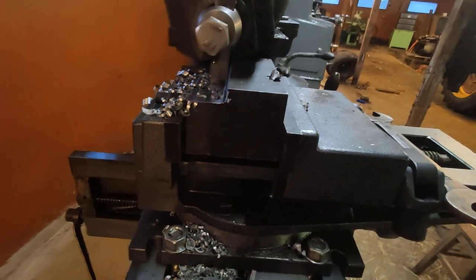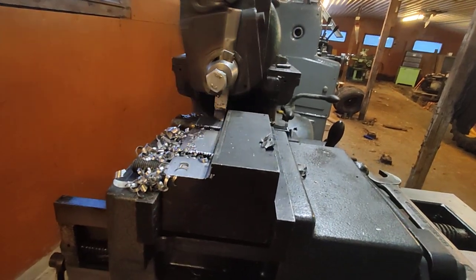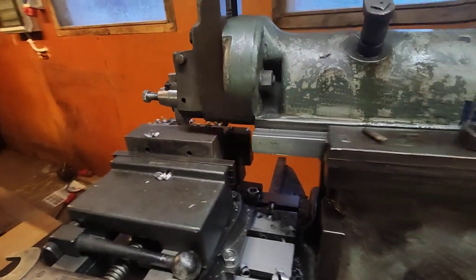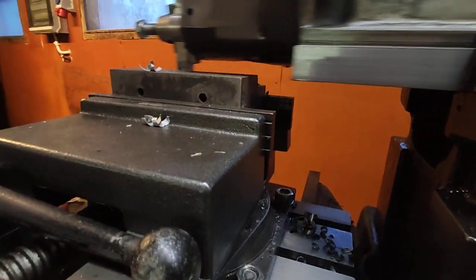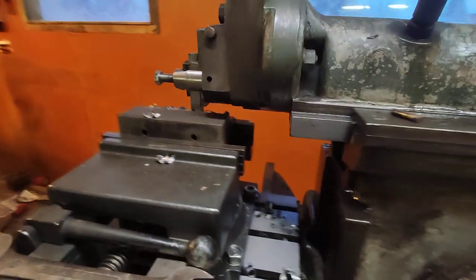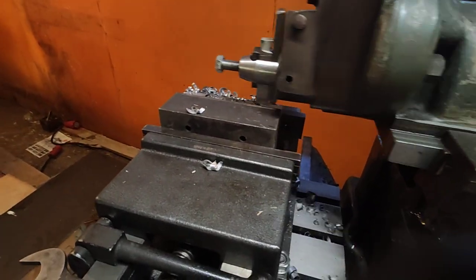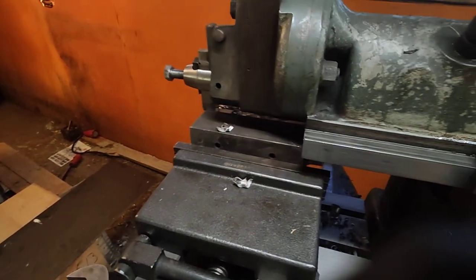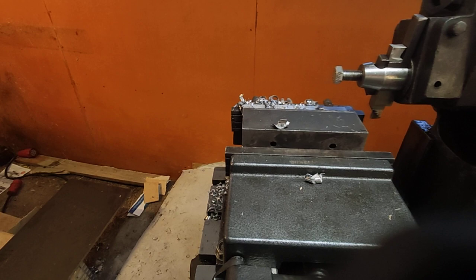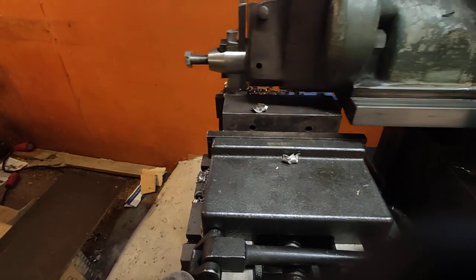Now the cut is almost to the shoulder. I will first be with my hand on the lever if it fails for some reason, but I don't believe it should fail. I would probably take an even deeper cut, but my current tool is not sharpened any deeper than 17 millimeters, so this will be the maximum cut — and I don't actually need to cut away more than 17 millimeters anyway.